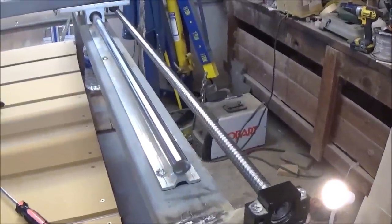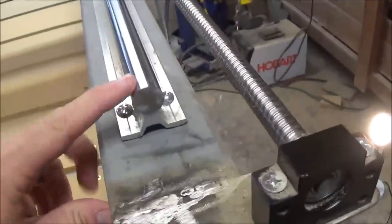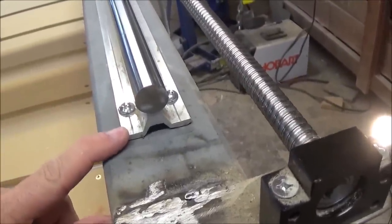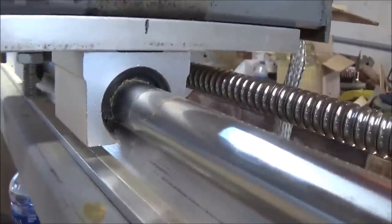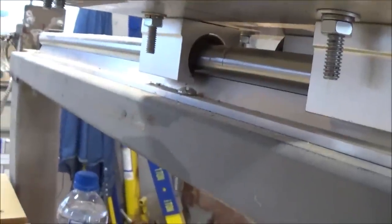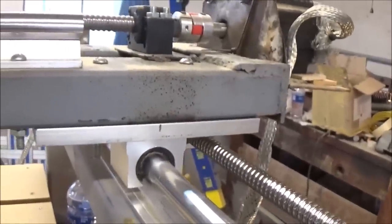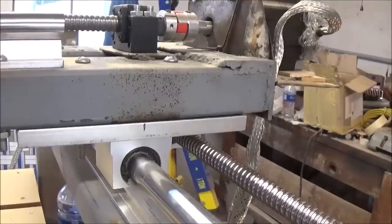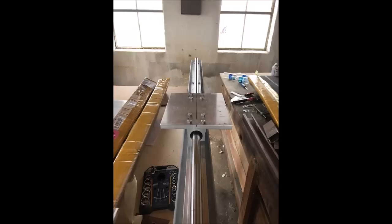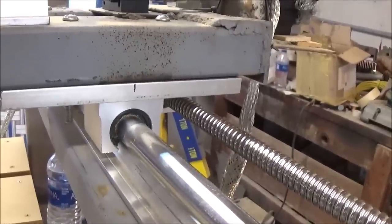Now I'm going to go up here and look at some other components. This is the linear rail — three-quarter inch rail, stainless steel on top, mounted on an aluminum base, four foot long. It comes with two of these linear glides. These are mounted to a piece of half-inch by seven-inch by eight-inch aluminum plate. I ordered one big aluminum plate that was eight inches wide and cut them down to make my glide plates. Those are just bolted to the linear glides.